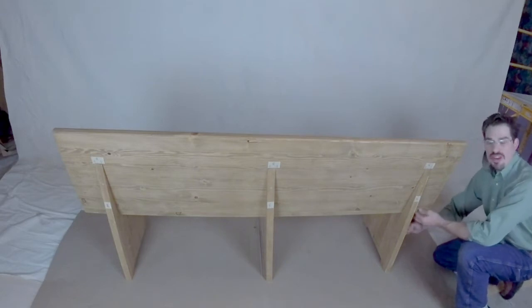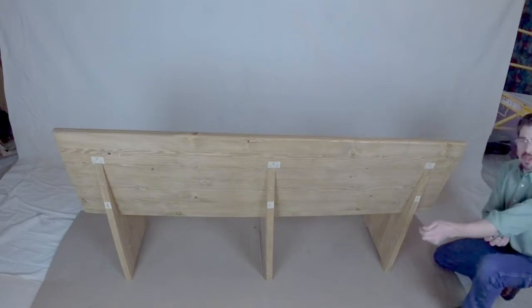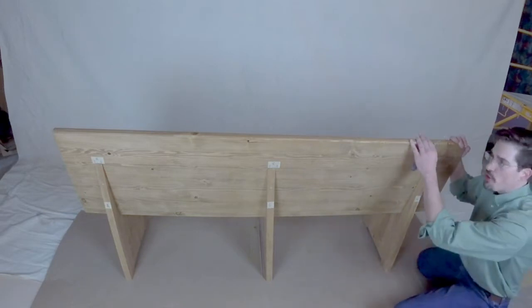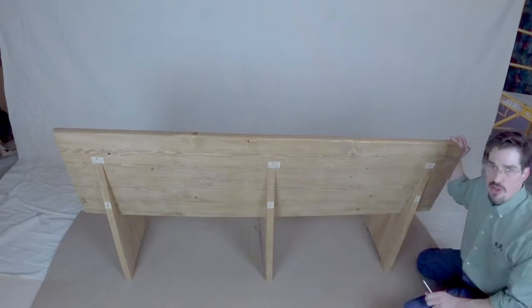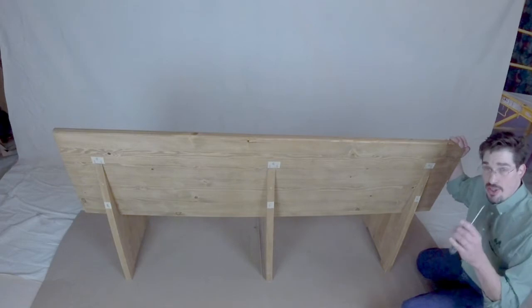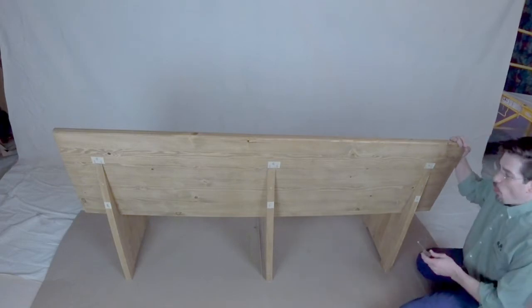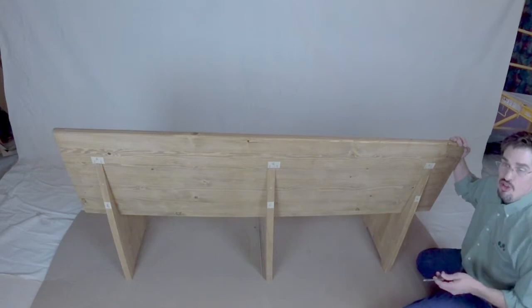That's the very last one tightened — they've all pulled down a little bit, and you can just feel them pull in. You want them tight, but not over-tight. That's one of the reasons I tell you to do everything with a screwdriver. It takes a little bit of time, but it's important not to over-tighten because you'll strip them out.